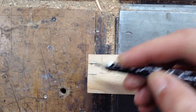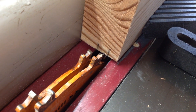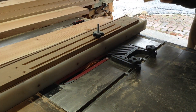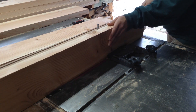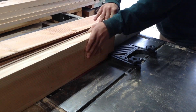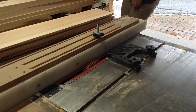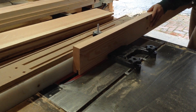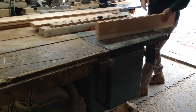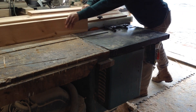The panel going in here is three-quarter inch plywood, so I'm cutting a three-eighths inch groove, three-eighths inch back from the opening. Three-quarter inch plywood is usually a little bit thinner than actual three-quarters, but that's the groove I'm cutting. From the thumbnail, you can see the entire face of this door is flush — the customer sent me a photo and I'm working off it. That means there's a bigger gap in the back, and I explained that to them. I used three-quarter inch plywood because I'll be routing into it, and half-inch would have been too thin.